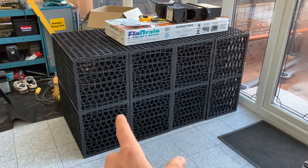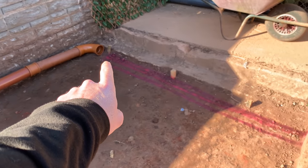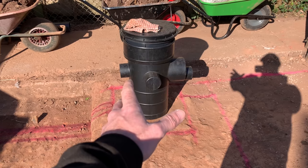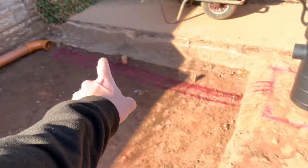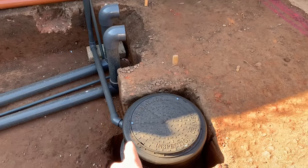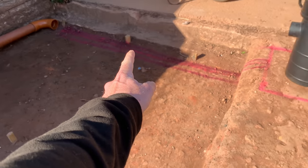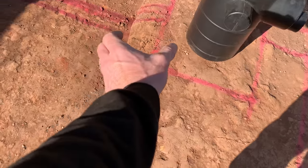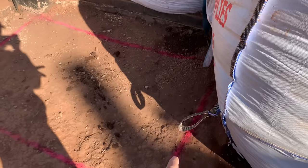It's going to be a huge hole. I'll get it done. So where we're at — there's my 90-degree fitting, which will run a pipe across into my sediment chamber. That will take out any big debris, blanket weed, moss from the guttering, and all the sediment. As this will be pumped around the same route, I'm going to keep the same channel and put it in here, running behind the back of the pond, then put a 90 on it and connect it around to the back. When I dig out and put my gully drain in along the front of the pond, I've got somewhere else for that to connect to as well.